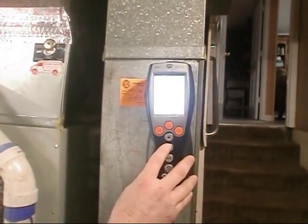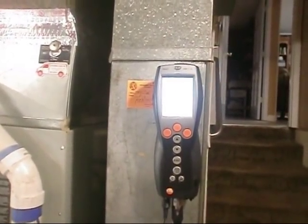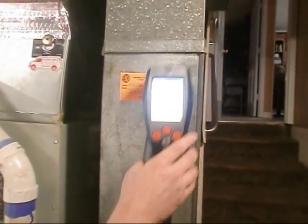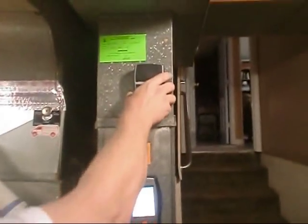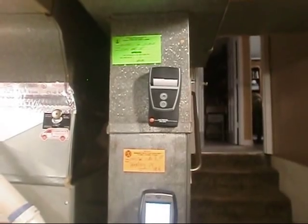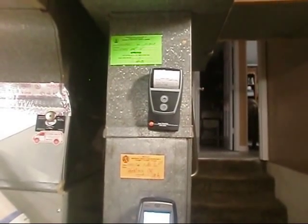That's really all this is going to show us. Stack temperatures, like I said, about 125, 130 on these furnaces, usually where they're at. Okay. Alright, so let's stop this. Love it. And now, I mean, it's cut and dry, Eddie. You can just leave that right there on the furnace, or show it to your customer. Tape it right to the ductwork.